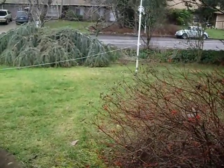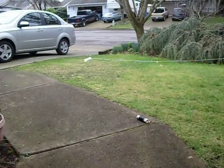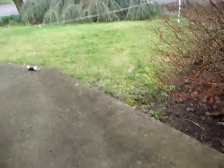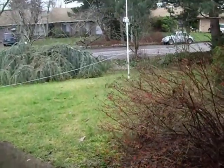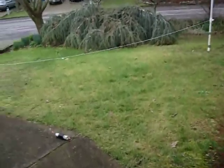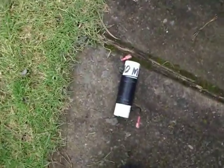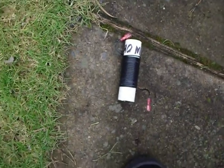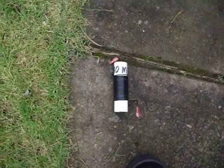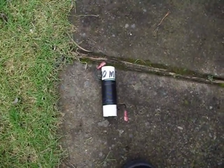The counterpoise is 27 inches on one end and 7 inches on the other end. I will try to make changes on the antenna and use the 40 meter band coil so we could try to get all the specs. I'll talk to you soon, bye bye.